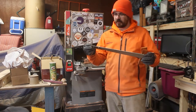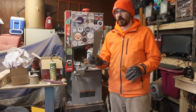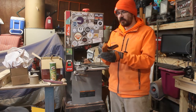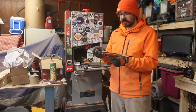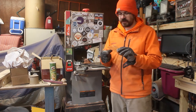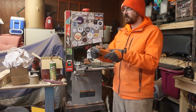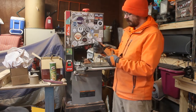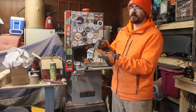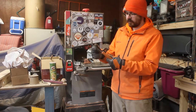So I've got the metal part — the blade — and I think I've sanded as much as I'm going to do. It probably still needs to be sharpened some, but I'm going to wait on that for now. Then I've got the scales, which will be the handles, and the dowel pins. I did a dry fit just to make sure it all goes together, and it does. Before I attach these with epoxy though, I want to get the front edges rounded over — I don't want to try to round this part down when it's attached, because then I'm just going to scuff up the blade. So I'm going to do that now, and then grab some epoxy and squish it all together.